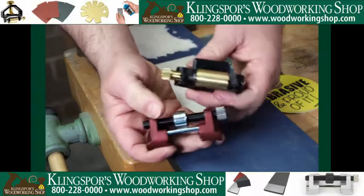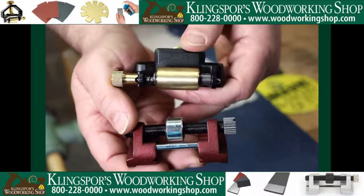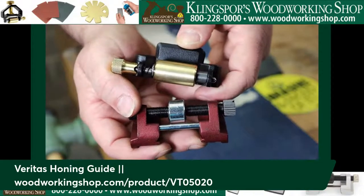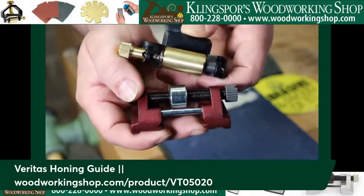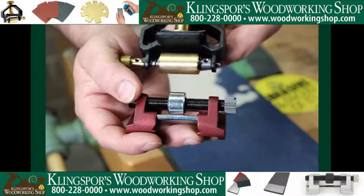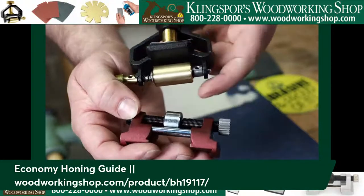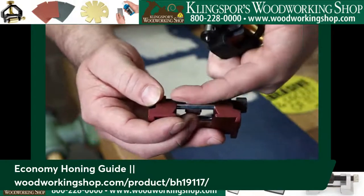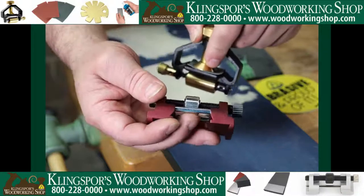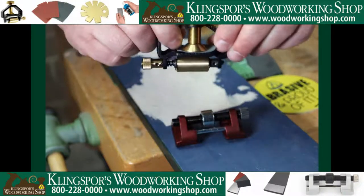Let's look at the two entry-level options. You can see this one has a much wider brass wheel than the other — this is crucial, especially if you're worried about balance. With smaller chisels, you don't want to start teeter-tottering on the wheel, which can create undesirable angles. I like the wider wheel — it gives more support. One closes in and out, while the other screws down and tightens on the back of the tool, keeping everything flat. If your tool isn't sitting flat, you're crooked right out of the gate.